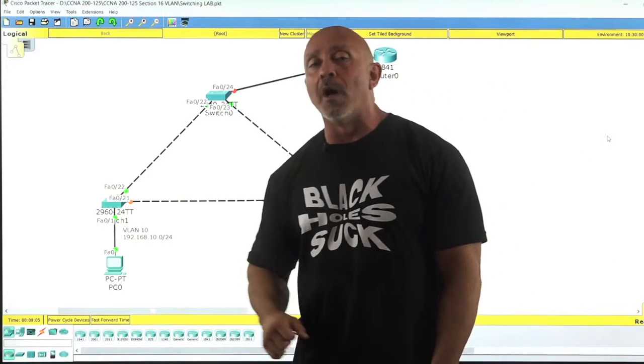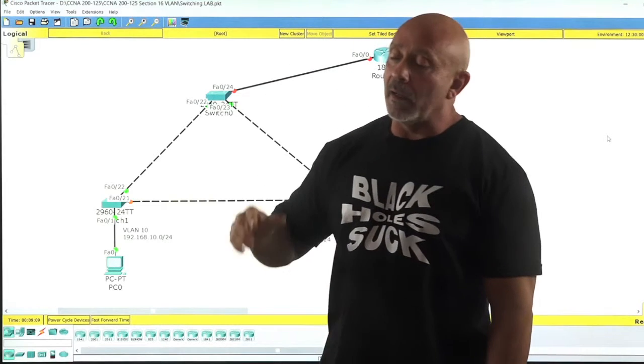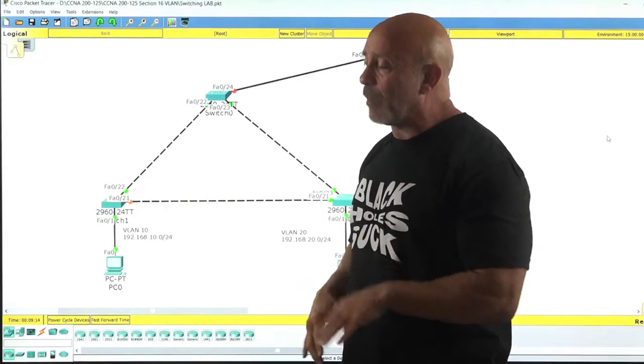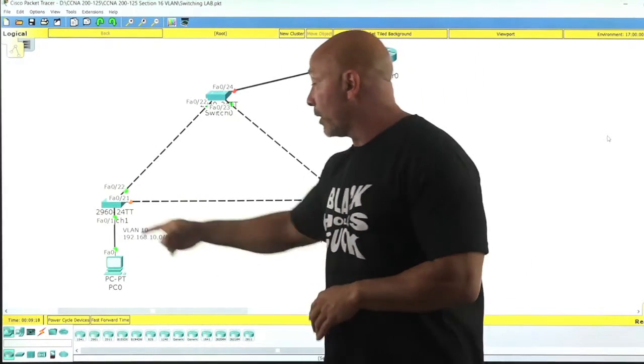We're going to allow only one MAC address because we're a rigid administrator. And if you try to be funny with me, I'm going to shut down your port. So we've got to tell it all that. And at the same time, we're going to do a little extra thing in there that we didn't do in spanning tree. We're actually going to turn off spanning tree down here.